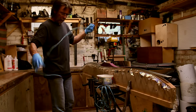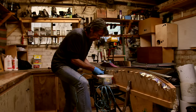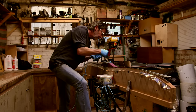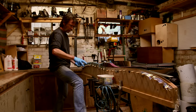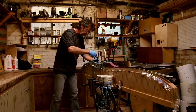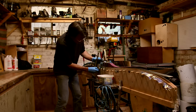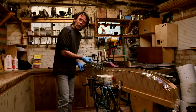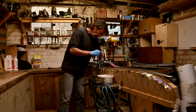The rope has loops in it which we can loop around the handle. We want to put a bit of pressure on this — not enough to snap the dowels, but certainly enough to start taking up any slack between the laminates. We'll put a little bit of pressure on the clamps and position this clamp right over the point where all the laminates come together and the fades meet, so there's a lot of pressure there to make sure we're getting a nice joint on that section.